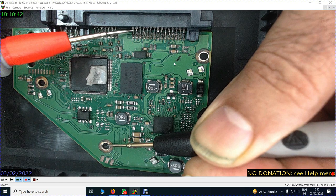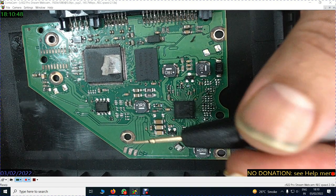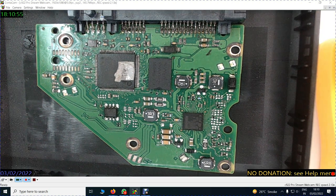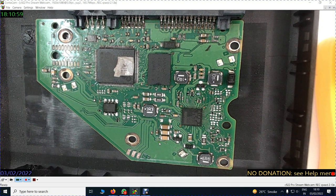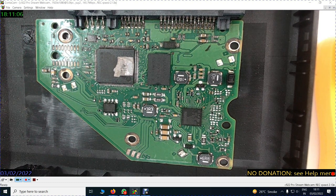So you have to really see where the voltage comes from. By experience, you will come to see many things. But let me introduce first: this green area is a grounding, where the black wire from the meter goes. Now that wire has to be kept attached. Your red wire is a free probe. Now you can attach it at various components and see what you get on the meter. If there is no voltage on the meter, that means you have touched an area which is ground or a non-conducting area.